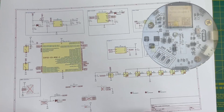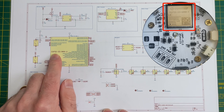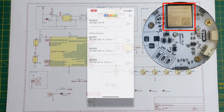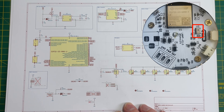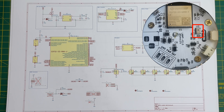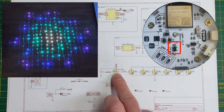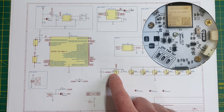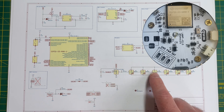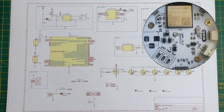Let's have a look at what I've done - quite a bit more stuff. The main thing is the ESP32 S3 mini, which lets us use the amazing WLED software. We've got a microphone so we can do audio responsive LEDs. For driving the LEDs I've used a driver chip - that was inspired from the LED curtains I took apart a while back. You can use one of these LEDs as a sacrificial driver, but these tend to need five volts, so I've got a driver chip to level shift the output from the ESP32, which is a 3.3 volt device.